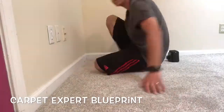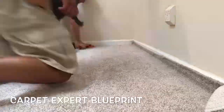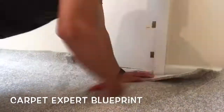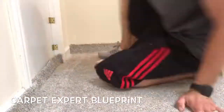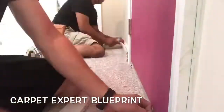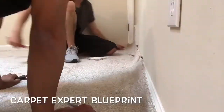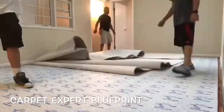Go ahead and kick on my set wall, trim and tuck it so everything's good, then head over to the opposite wall from the one I just kicked and stretch that on hard — throw a good tight stretch on it, trim and tuck, then fall back to the set walls just tapping those on nice and easy. Flowing over to the opposite walls and blasting them on to make sure the room is completely stretched tight with no bubble issues whatsoever. That's the lazy man's trick right there — see how I did that little slide under the door? Who wants to pop a door off if you don't have to?